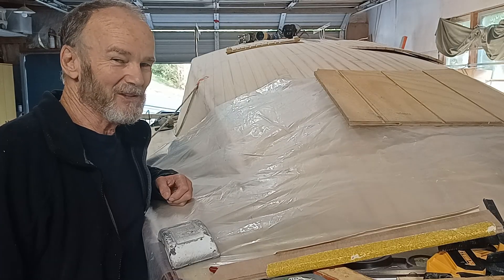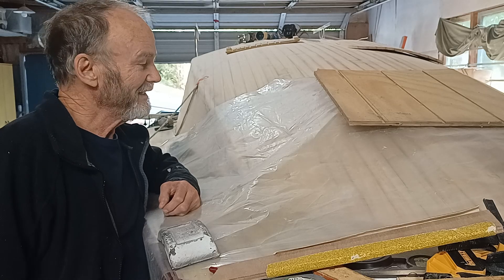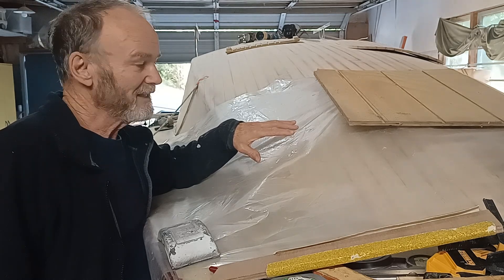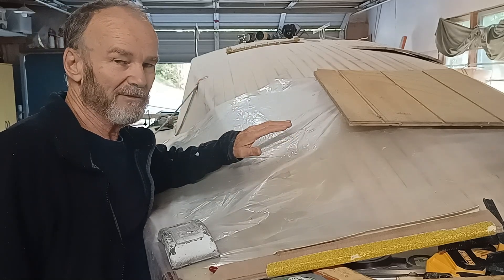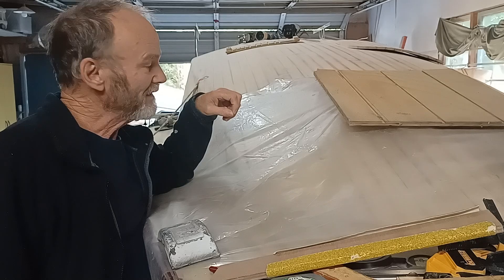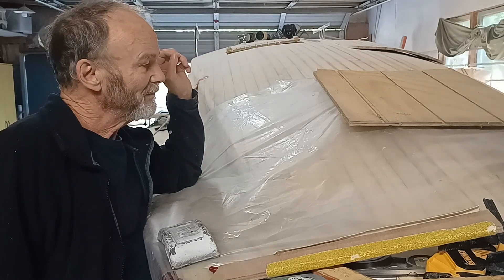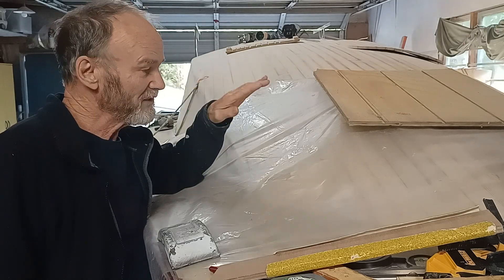Good morning — just let me turn this off. What I'm doing here is trying to dehumidify the deck a little bit, because yesterday was a very humid day with some rain. It's not until late in the day that the deck usually shrinks down a little bit and sits on top of the temporary frame snugly, especially when you take the screws out. To stiffen up the deck in this area, I want to start with a little bit of glassing around this hatch so I can tick something off as completed before moving back onto other areas of the cabin. I think it's already moved down a little bit.